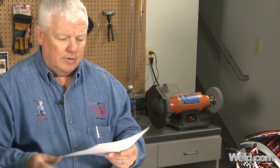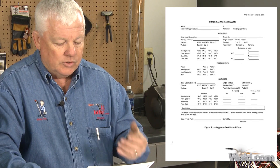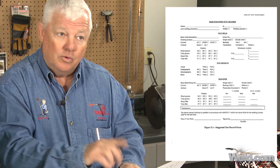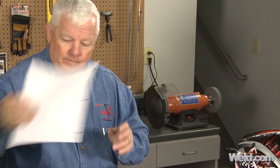I've picked this test — the 4130 — as the first one we do, and I've taken some pages out of this spec to share with you. The first one is a qualification test record. You or somebody in your group is going to have to fill this out, saying: I did this welding, this is how I did it. You sign it off — this is your test weld. It tells you the position you welded in, and position is critical. If you weld flat, it doesn't allow you to weld vertical up or horizontal. So pick that out carefully. That form will be in the notes at the end of the show.